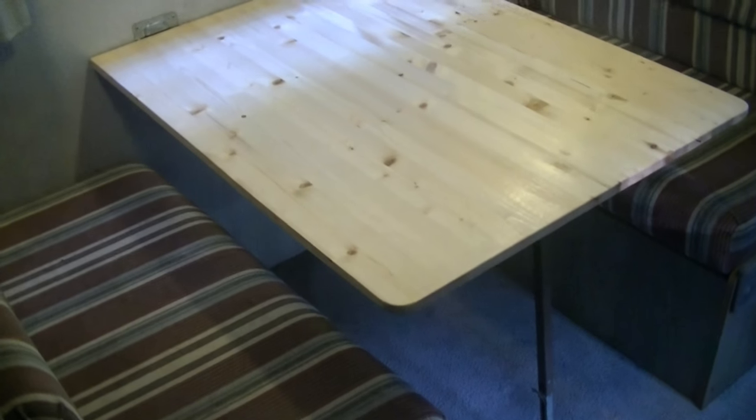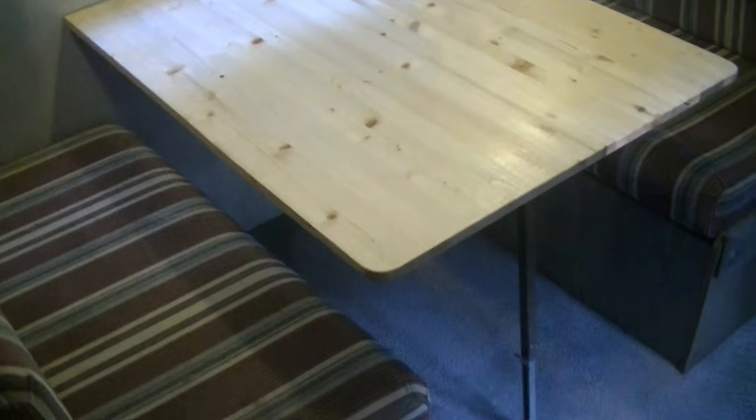Here's the table all in place. I know I skipped a little bit — I forgot to record what I was doing. Did a bunch of sanding, put some clear finish on it. It really made the color pop out — kind of a yellowish because it's oil based — and it looks really nice. Then I had to do underneath. So underneath I ran the brackets that go right to the edge. They can't go quite to the edge because they have to sit on this lip here, so the support board has to be back that far. I ran four of those, and that should keep it from splitting on the seam. This is where I mounted the leg on one of them, and I also glued another board there for the other part of it.